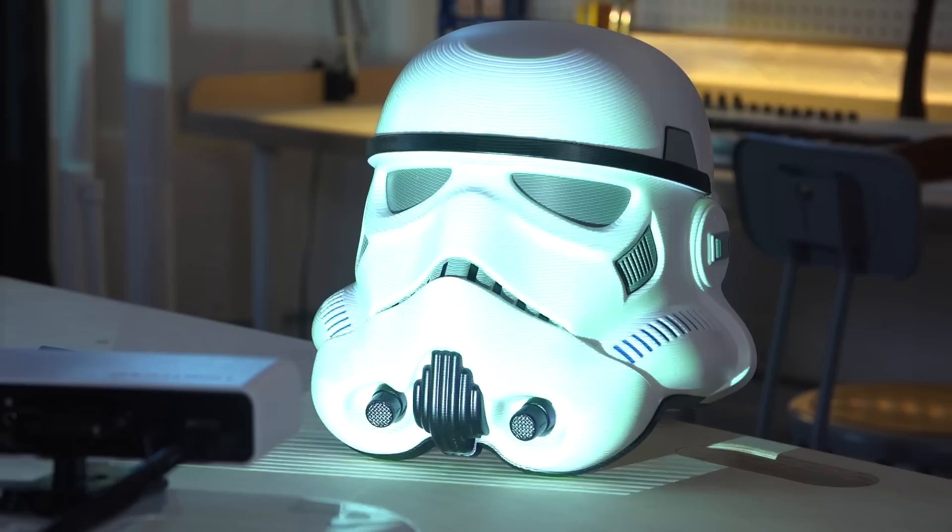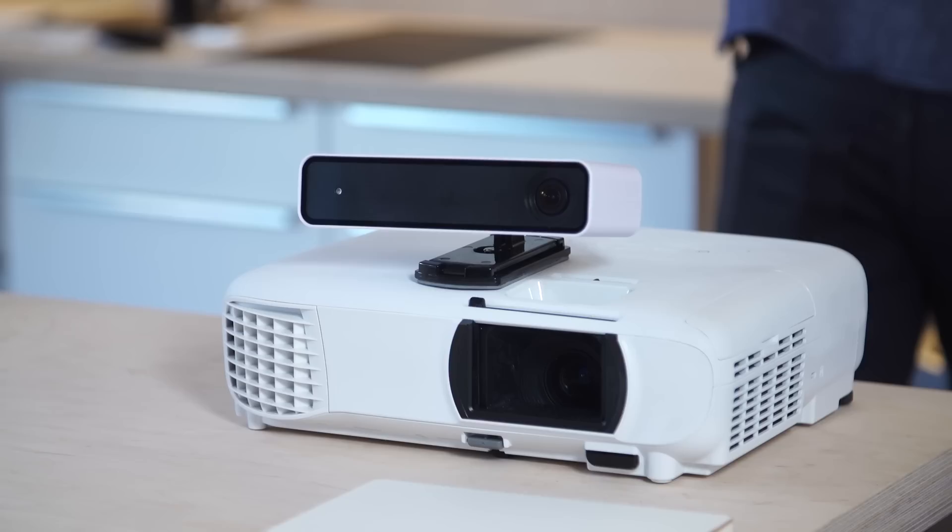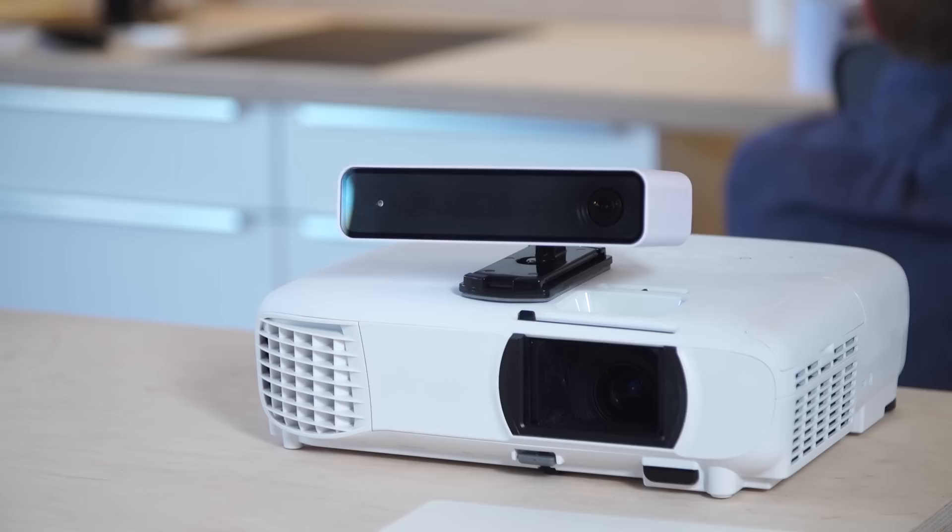In a lot of AR devices we've seen, mapping the world and understanding shapes is a huge part of it. How does this do it? Here I see it's one lens — you're not using IR sensors or stereo. How does this understand the shape? It is stereo — the left eye is the camera of the Lightform, and the right eye is the projector. They're actually talking to each other through light. Those black and white patterns were zeros and ones — it was sending binary code to each other through light. At the end of the day, we get a projector-resolution scan — a 1080p scan of whatever you point at, much higher than a real-time depth sensor.